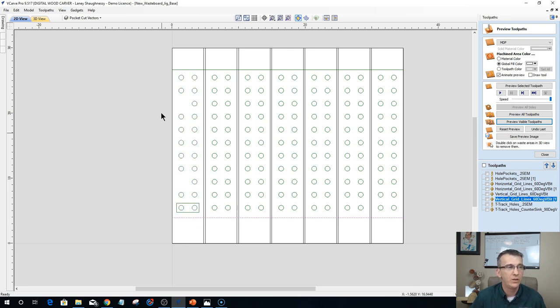So what I need to do is I need to bring all of this down to my 0,0 to create my tool pass. And you're going to do the same thing. So this is crucial. This is the part that is going to be important that you kind of comprehend. And if you don't comprehend, let me know and I'll try to do better explaining it. But we have to say, hey, we're zeroing out on our corner here, but I got the job set up like this.